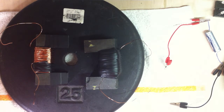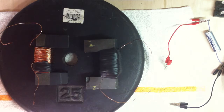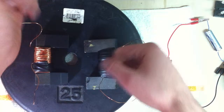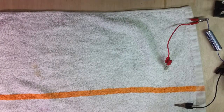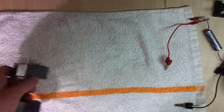Very pure iron can give you that, or there's a product called Metglass, and essentially all that is very pure iron which has been heated up very hot and then cooled extremely quickly so that it has absolutely no time for crystals to form throughout its structure. So instead of globs of iron forming and then stacking on each other, it's just tiny little disordered pieces of iron throughout the entire structure, and that gives you a very high magnetic permeability. I don't know how to explain that well at this time, but maybe later.